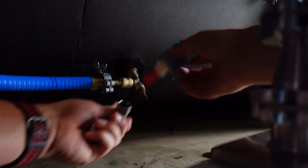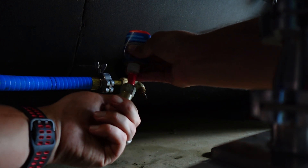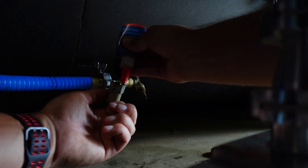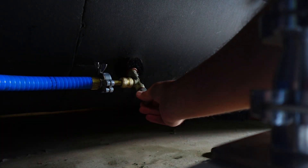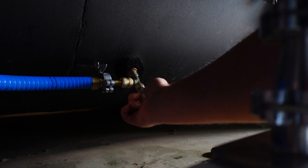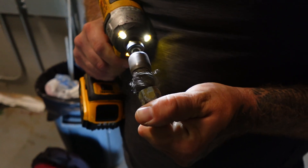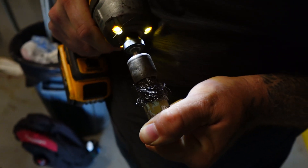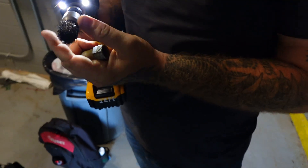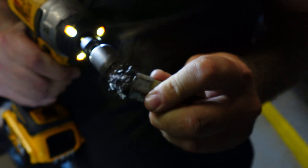With the nitrogen out and everything prepped, we finished hooking up our vacuum pump to get it spinning. I do like to Nylog all my caps and ports on my machines as part of my evacuation prep process. The cap on the valve I'd be using was very corroded and I did not want to trust that even with Nylog, so I recommend using a small cone metal brush to get in there and clean those out.